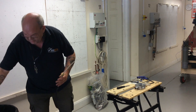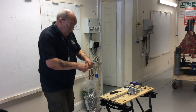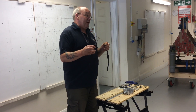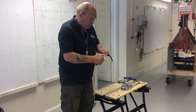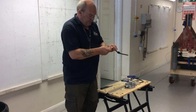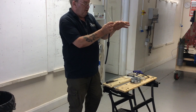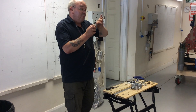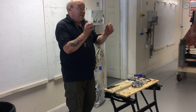You then terminate into the back of the supply side of your fused connection unit. On the other end, where we're doing the 10 to 15mm, gently — with an emphasis on gently — score around your cable, not too deeply, just score around it, and then it snaps. There you go. Obviously that's your line conductor. You utilise the grey as a neutral and sleeve it with blue sleeving. Your black is your CPC and therefore you use CPC sleeving on it. And that's it — done.